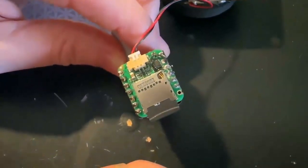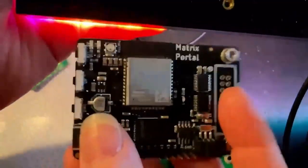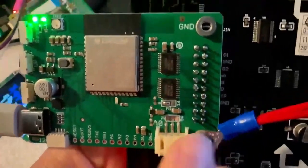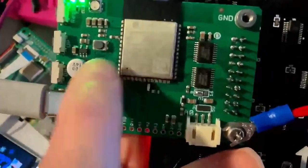This is LED Sand — a fun all-in-one demo for the Matrix Portal. This is my latest Matrix Portal board: the Matrix Portal S3. Originally we had the Matrix Portal M4 with a SAMD51 and an ESP32 co-processor, then I designed an unreleased version with an S2, but then the S3 came out. The S3 has a really cool built-in peripheral that makes driving RGB LED matrices really fast. This is my prototype — not quite silkscreen-ready but same hardware and pinout, with STEMMA QT, reset button, a couple GPIOs, NeoPixels, and an accelerometer, which makes it perfect for LED sand demos. Thanks to 2MB of PSRAM, it can drive maybe 24 or 26 panels in a row as long as you can power them.